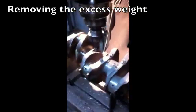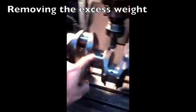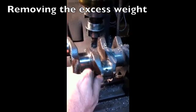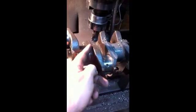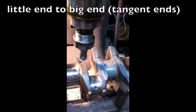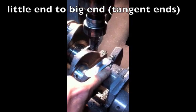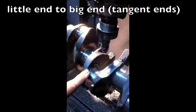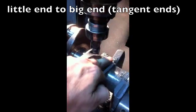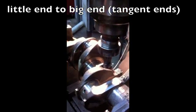What we're going to do here first of all is get rid of the excess meat between the two points. Obviously that's where she bolts in the block. That's where your conrod goes. So basically all this metal here, it's just excess weight. So what we do, we lighten it so it looks like this. We take from the top of that one to the top of that one — the tangent point — and then just machine it off. So we're taking about 14 mil off the top of this.